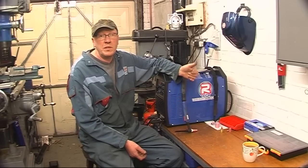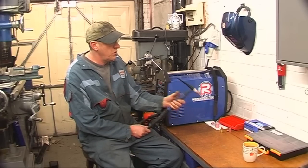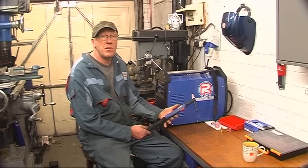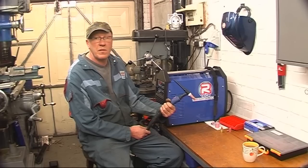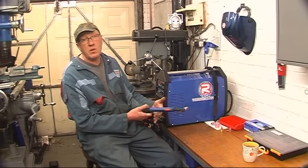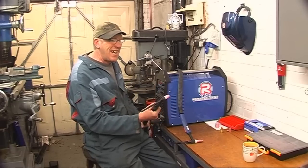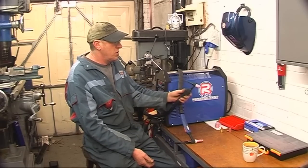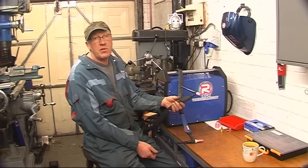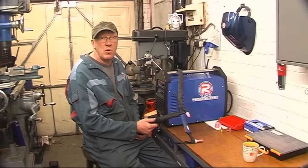I'm going to talk a little bit about the torches. The torch that comes with the welder is an SR26 torch — it's a nice torch but it is quite large, seeing that the welder is capable of doing 200 amps, so obviously they're supplying a torch that will carry 200 amps. I got on the phone to Artec asking what they would suggest for a smaller torch, and they came back suggesting a WP9. The WP9 torch is a lot lighter and a lot more flexible, but it's only rated at 125 amp on DC and 80 amp on AC, which will be enough for 99% of the work I'll be doing.